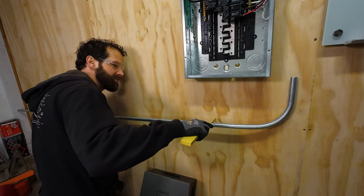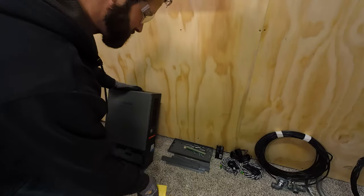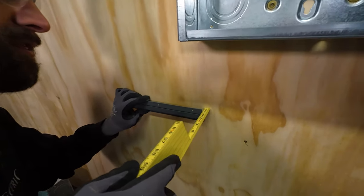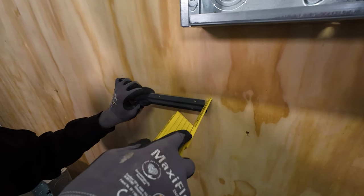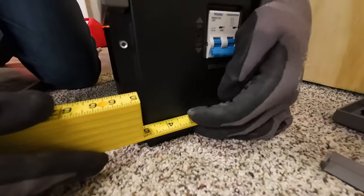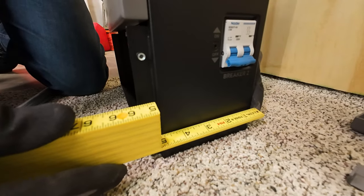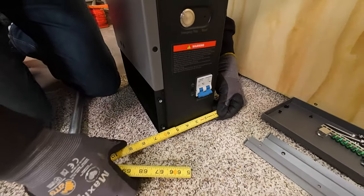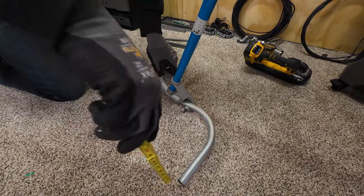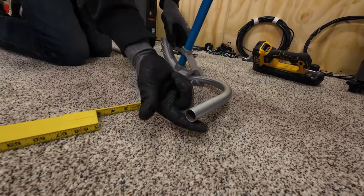An inch and a half kick is not going to be enough. That's the distance from the wall to the inside of the conduit. For my Anker Solix there's space for the brackets — these French cleats. We've got three-quarter up to seven-eighths. There's a little bit of intentional play in those brackets. I'm using reducing washers so I'm not measuring to the back side of the hole. I'm going to call it three and a quarter — four inches. So with heavy pressure on the shoe, I need a four-inch offset.